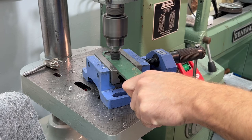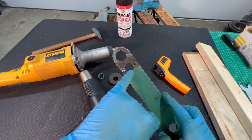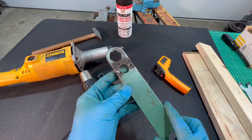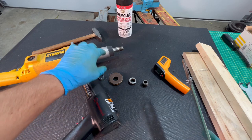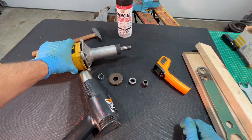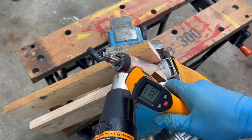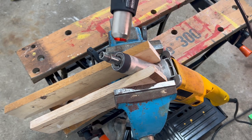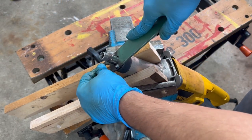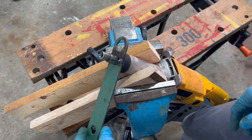We're not giving up on this thing — I really want to get those bearings out of there. I've made a custom tool with just a little bit of clearance in the hole so it can go over that shaft. I've welded two stainless steel pins to the steel bar and I think this is going to work fairly well. One possibility is that this is a left-hand threaded nut and I've been tightening it rather than loosening it. No markings on there and the instruction manual online is horrific. So I'm going to try heating this up with a heat gun — I've got black paint on there so I can gauge the temperature. We'll try righty-loosey. And look at that — look at that!